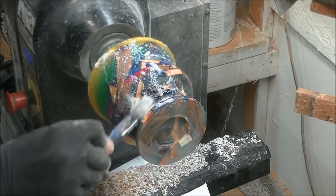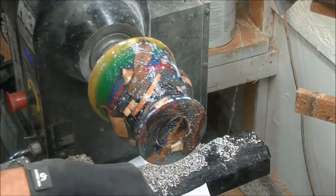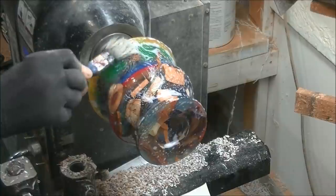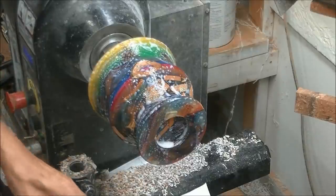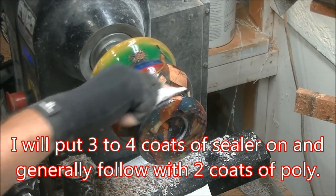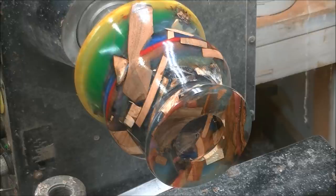I do it my usual way — been doing it this way for years. I lay it on thick, let it sit a minute, and then sort of rub it in with a paper towel. After the first coat I'll have to hit it with like 400 steel wool or something because it will raise the grain on the wood. I don't think it raises the grain on the epoxy but it does on the wood. That's the way I do it.